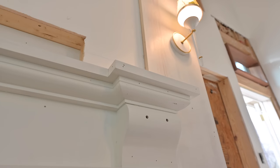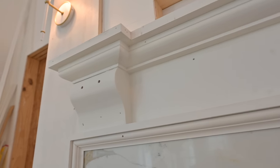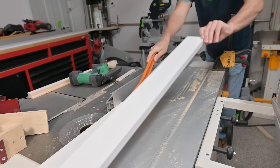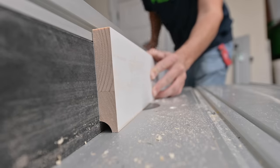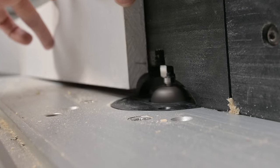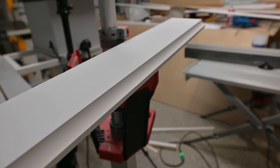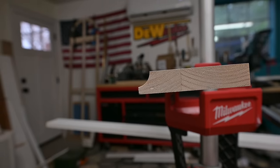There's a look at the bed molding with the soffit — at this point I'm feeling so good because so much work goes into this mantel and to see an actual shelf going up is just a really good feeling. With our soffit board install complete we can begin working on our fascia. Just like exterior work, the soffit and fascia in this cornice are called the corona. Since it mirrors exterior details, even interior cornices have a drip edge — that's why I'm milling this cove onto our fascia board.